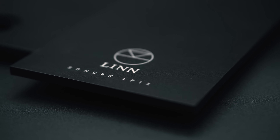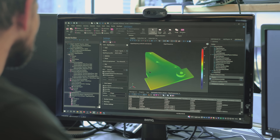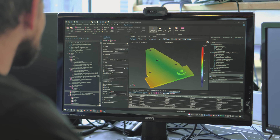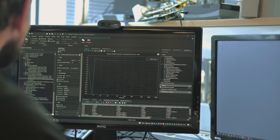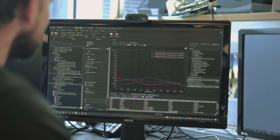With these design goals in mind, we set about designing the Keel SE and more specifically running finite element analysis to design and optimise the bracing structure of the Keel SE. To run the optimisation of these simulations, we built a heuristic neural net which looked at prior results and sought ways to improve upon those results to get closer to our design targets. Quite literally, the optimisation evolved within itself to produce a result that matched our desires and our expectations.